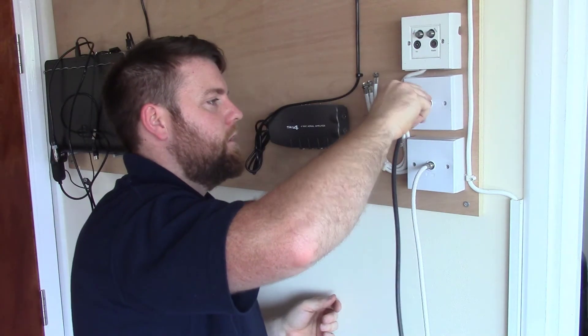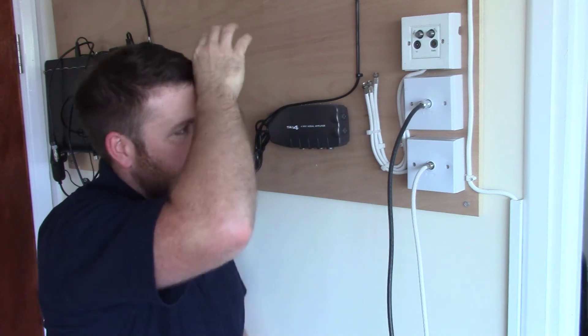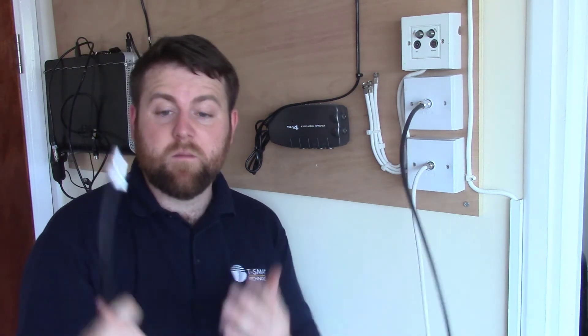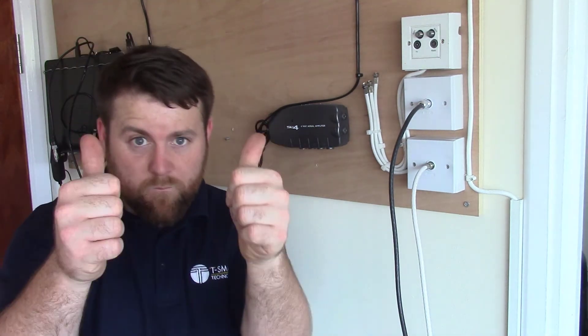That can go straight into our socket. The socket should be quite snug — if you've got a little wobble or it's falling out, replace the socket because you've probably got a break in there somewhere. The other end you'll need to make the same connection, and then that goes into your TV. I hope this video is of some use and saves you money, and maybe improved your aerial reception where you've taken an old poor lead out and put in a good high quality bit of coax. Make sure you're getting good coax — what's the point in compromising your whole system to save 50p? Please give this video a thumbs up, share it, subscribe to our YouTube channel, and that's it — I'm Tom from Smart Aerials, bye for now.